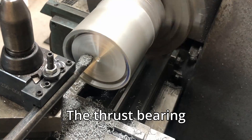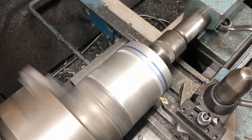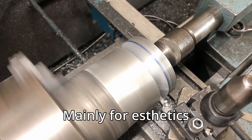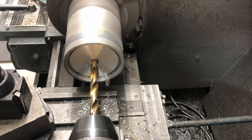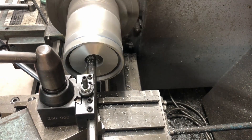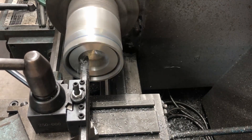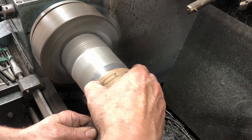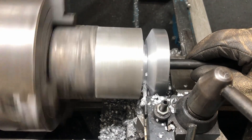That gets taken down anyway as you can see in the final cleanup. This surface here is where the bearing is pushed up against the body of the spin indexer. While I have it centered and supported I just wanted to cut through and add a little chamfer there as a bit of a feature. Lastly we drill and bore out the center to the correct size — this is a press fit onto the spindle, and the other almost identical part for the back is a slip fit. Before parting it off I give it a cleanup with emery paper, and we finally cut the part off.